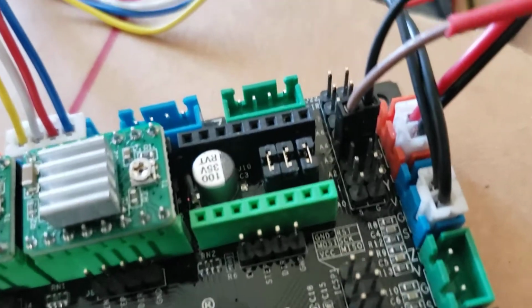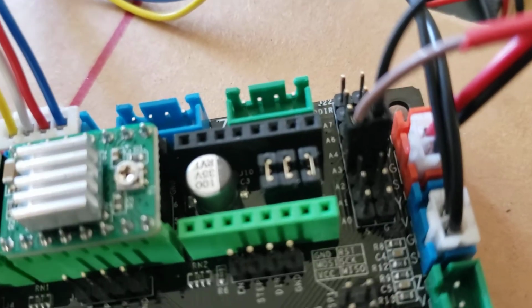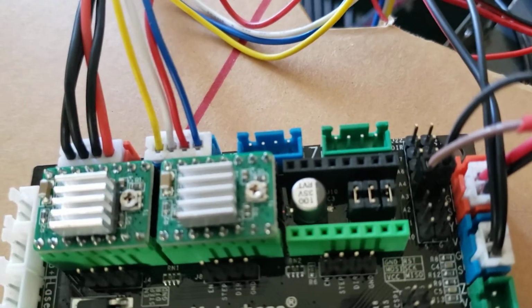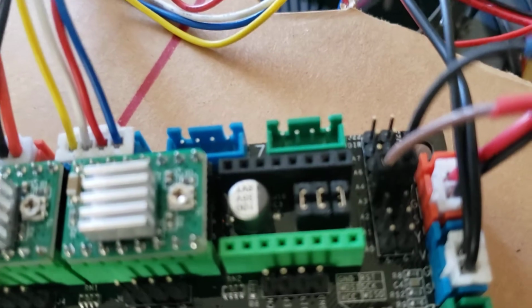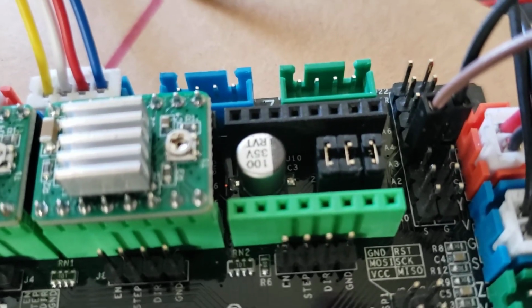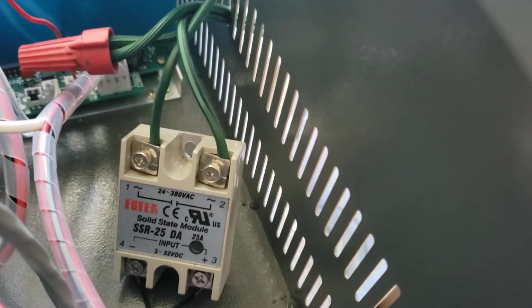And I found out this right there, this eight, I think it's 8.3 one. When you turn on the, I'm using Lightburn. It gives five volts to one of the two wires. I think it's the brown one. And then those 5 volts turn on the relay, and then that relay turns on the power.